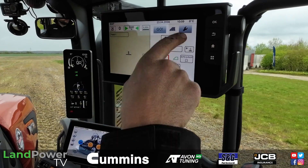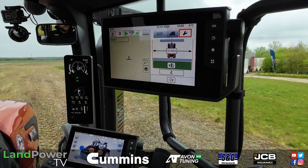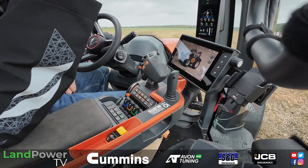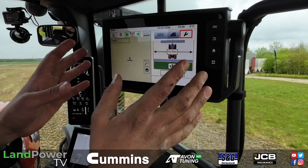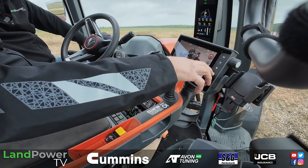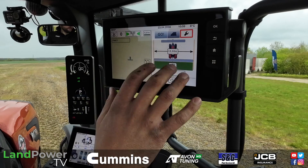I can set that up through my technology screen here on the spanner. This is a secondary optional screen — you don't have to have it. But say we had an isobus implement, we could have our isobus shown on this screen and all of our tractor functions, and then just concentrate on this for guidance, or the other way around. For this example, I like to see my tractor functions on the A-pillar screen and have my guidance here — split it up so I can see everything all at once.